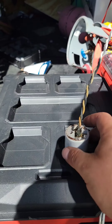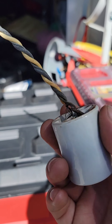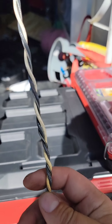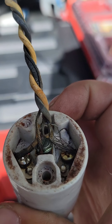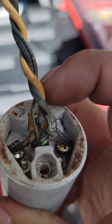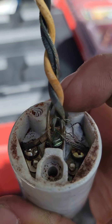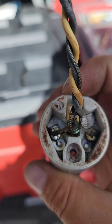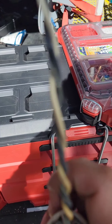When the light bulb goes out they quickly change it with a twisting motion. Because one piece pretty much free-floats — it's suspended and only connects to a plate that is able to move — when you twist it so many times, this happens. That's not really an issue until you get down to where the wires begin to touch and you start to get a short, because the black wire is going to touch the white wire. The one that did burn out was actually touching and that was causing a spark.